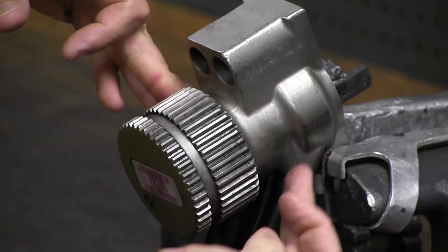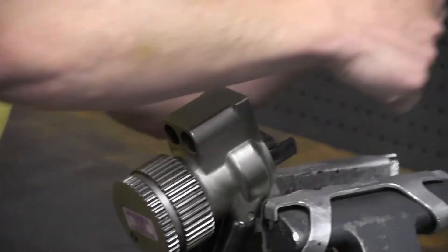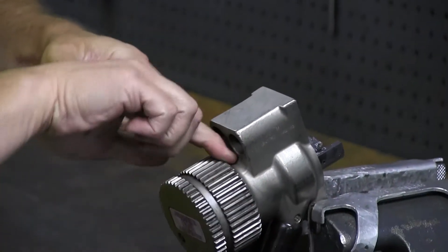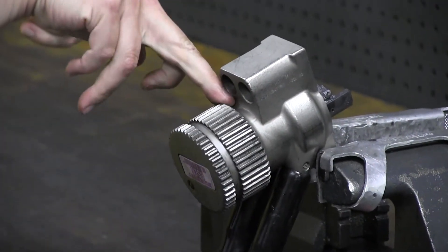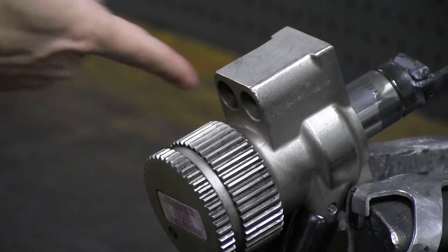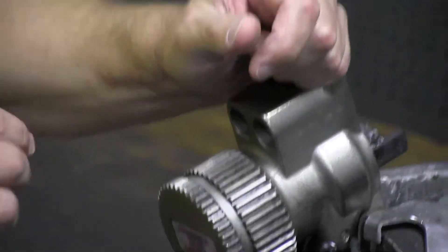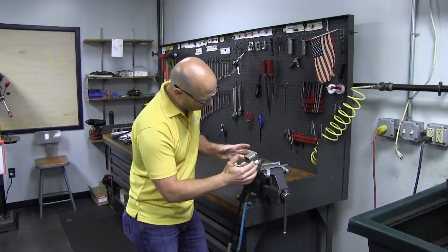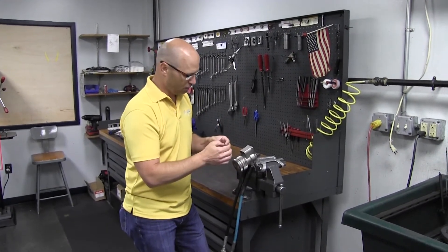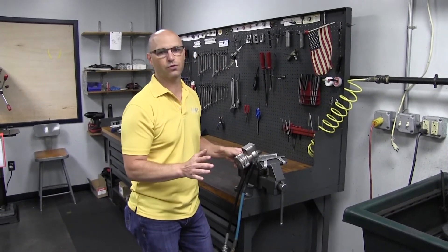This is not a place where you'd see a typical oil leak. There are hoses going into the tool, threaded nipples — male and female — so if those are loose or there's a crack in a fitting, you'd see oil there. There's a piston moving in the front of the tool with a gland, seals, and O-rings — you'd see oil leaking there. But you would never just see oil leaking in the throat of the tool. That oil continuing to come out from an area with no O-rings, no stress points — that is porosity. This tool is cast; our tools are not.